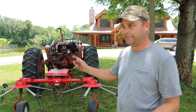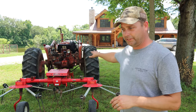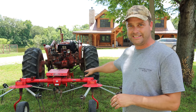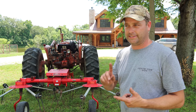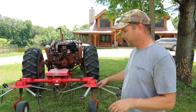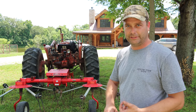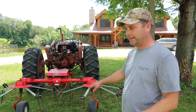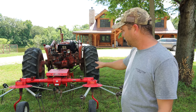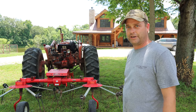While we're doing this, we're going to try to run the engine on the Allis Chalmers as slow as possible so the PTO runs slower. We want to ted the hay as easily as possible — we want to get the hay to turn over and mix up, but try not to tear up all the alfalfa. I haven't tried tedding with the Allis yet, and I'm hoping it's going to be able to spin this a lot slower. Let's go ahead and try it out.